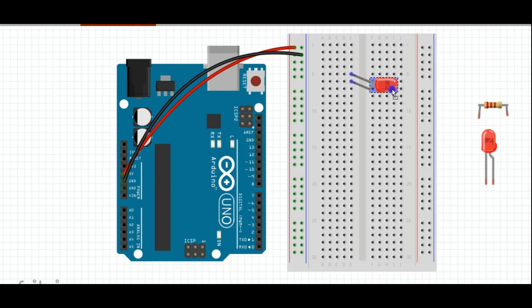Here I've got this one turned to its side. I can bring the LED to two holes in our breadboard. Notice that I've connected them one on top of each other, because inside our breadboard, all of these pins are connected in this pattern. So these are connected underneath the plastic cover with a conductor, so that any one of these 4 pins will be connected to this side of the diode. This is my longer side of the diode here, and since that's the positive side, I need to hook that up to the positive power.